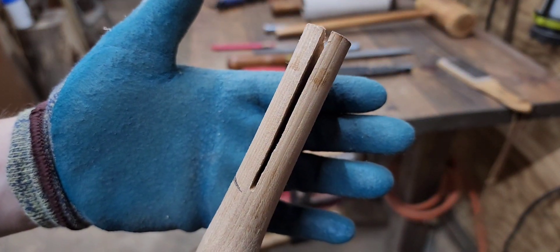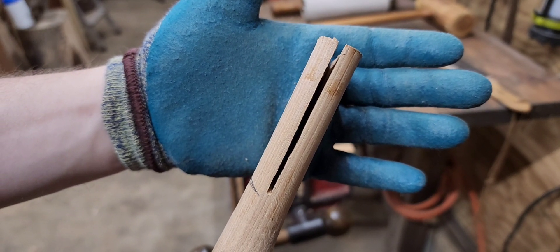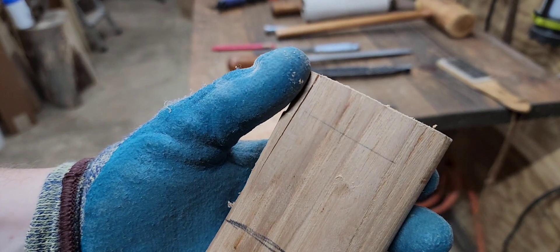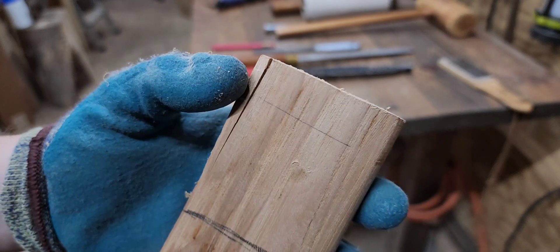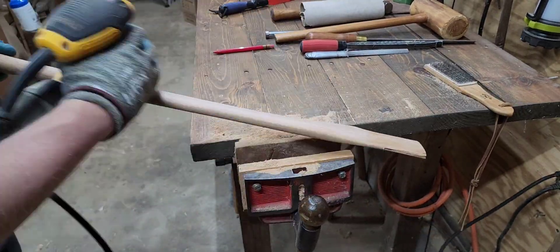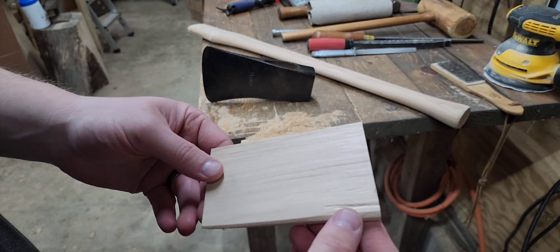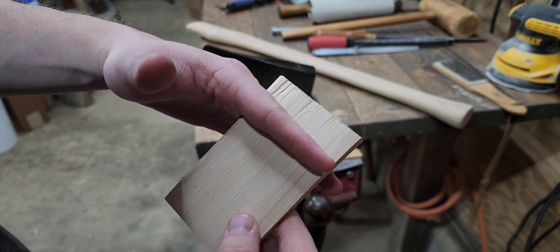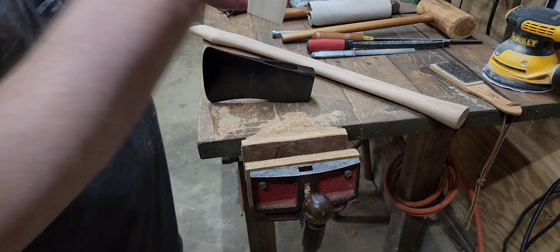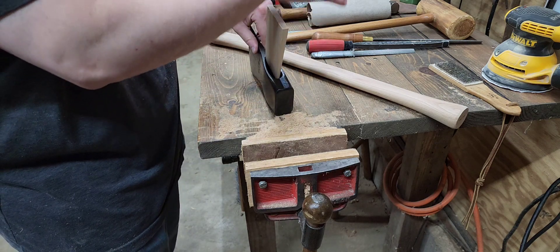The whole purpose of putting that C-clamp up top and then re-sawing is to create that tapered curve — it's not too much, not crazy, but it's enough to help get a little bit fatter of a wedge in and hopefully get better compression. You can see a little bit of unsupported grain crack in front of the tongue, but that'll be fine. Got a wedge made up — some chipping at the top, but when it's fully seated it's only going to show that much, so not to worry. Just going to thin it down a little bit front to back.